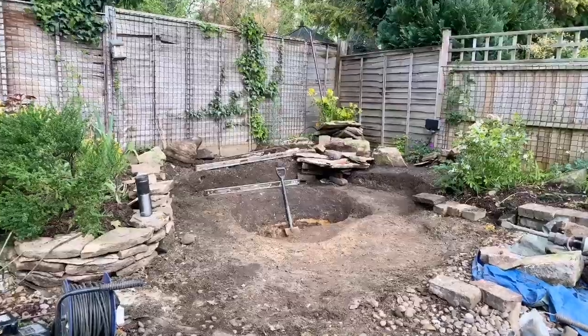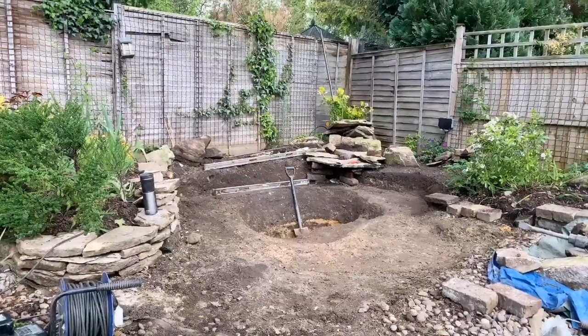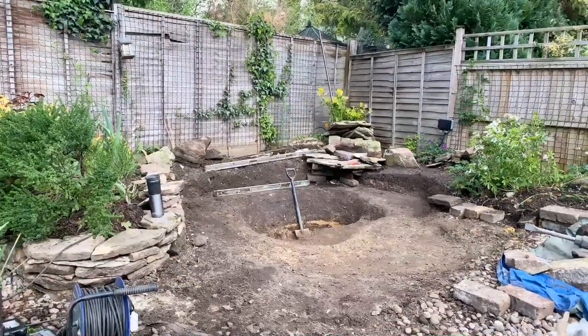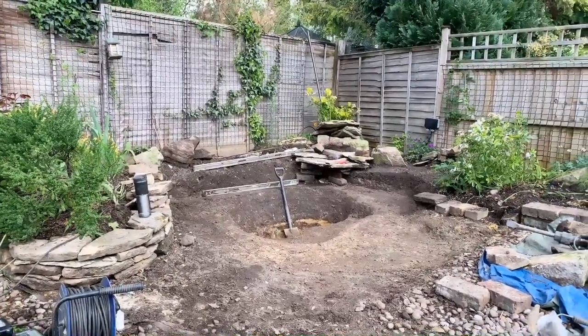And I wanted to show you really the way that I like to put ponds in, the design and the method of the construction that goes behind it, because the excavation is pretty much the most important aspect of building a pond. So when I'm digging out a pond and excavating, I like to build various levels and terraces. From a wildlife point of view, they like to have lots of shallow sections. Shallow water can be very fertile, great for plants, allows lots of light to penetrate through the water. From the fish point of view, they want to have a deeper section where they can hide away and get some refuge from herons and other predators. So when I'm digging out a pond, I like to build different zones, different depths.